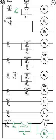Now, when that closes, what happens? Well, this is where the memory occurs. This circuit remembers that this has closed. Let's take a look. We know that's closed because a long time ago somebody pressed play. When this closes, that energizes, this becomes closed, and this remembers the fact that the cylinder has extended. Now, when it does extend, this also energizes.